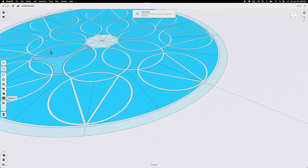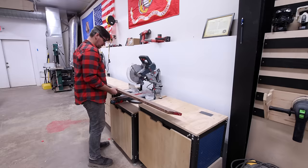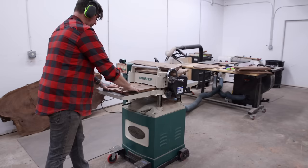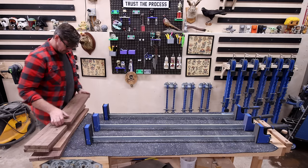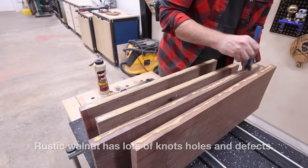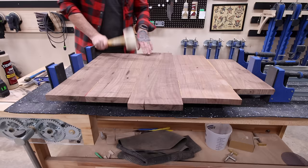It's not really marquetry but maybe some sort of bastardized version of marquetry that I'm calling a mosaic inlay, and this seems like a great way to use up all those scraps I've had laying around. I've been milling up the wood and resawing the lumber to get the most usable material out of the scrap walnut. For the top, I'm gluing up some rustic walnut boards to give most of the thickness it needs — I want to hide these boards so the mosaic pieces will get glued on top. The CNC is scratching in the reference pattern I'll use to glue on the mosaic pieces later. I know this seems like an extra step and it totally is, but I have a vision for how this table will come together and this is the best way to do it.